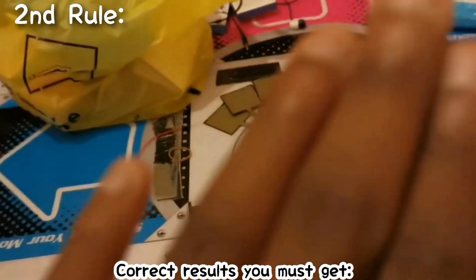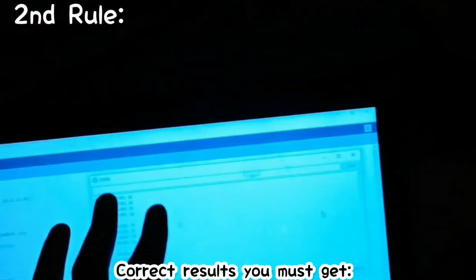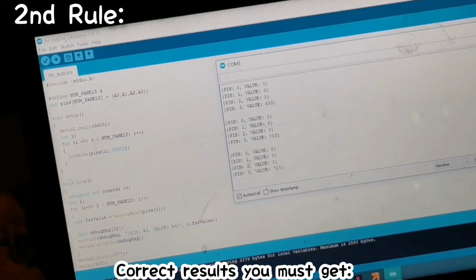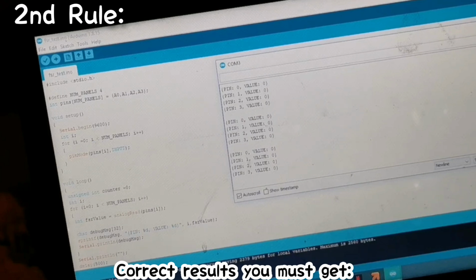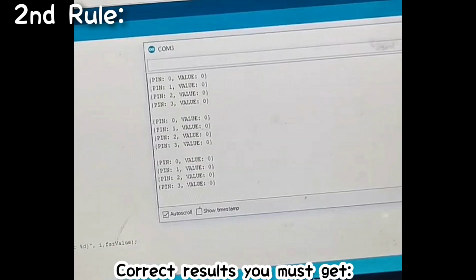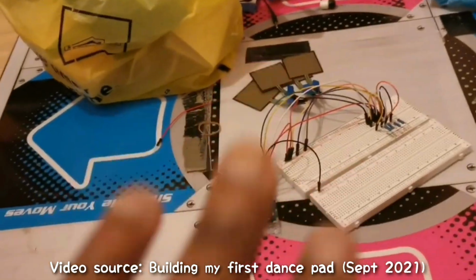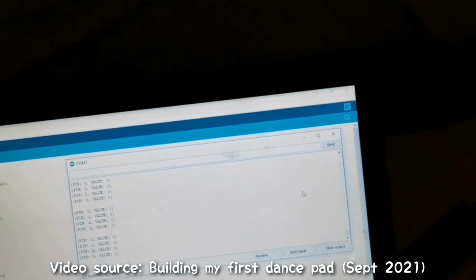If this code returns an integer on one line of code out of the 4 code lines, when one assigned FSR sensor relates to that particular line of code and that FSR is in contact, that is a verification that your FSR sensor is working perfectly well. The harder you press and apply pressure to that FSR, the higher the integer value will increase, and vice versa when you press the FSR lightly.